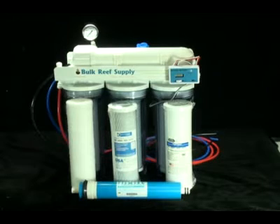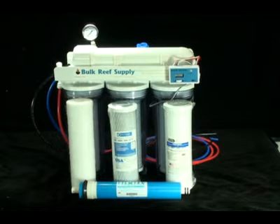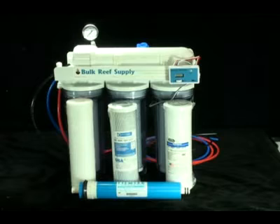The second is filters. At the end of the day, an RO system is only as good as the filters used inside of it. Our first stage is a PureTREX depth sediment filter. Because of its graded density, it's able to capture particles throughout its entire thickness, rather than just on the surface like typical sediment filters. This results in longer life and fewer change outs. Our second stage is a 5 micron CTO2 matrix carbon block — the most widely used in the entire world.